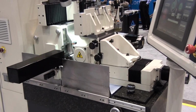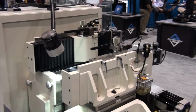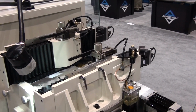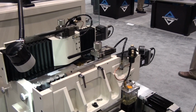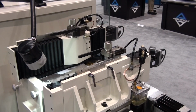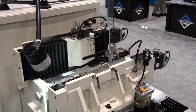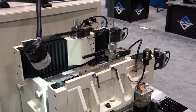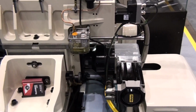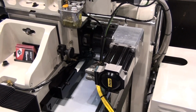We added stepper motors and ball screws to our dressers for programmable traverse rates as standard equipment. With this new platform, wheel dressers are offered as air sensing, automatic dressing, over-the-wheel CNC, as well as rotary diamond disc CNC platforms. On the TG-12x8, we upgraded our regulating wheel servo drive with 170 foot-pounds of continuous torque with an 8-to-1 gearbox. The main spindle motor is 10 horsepower.